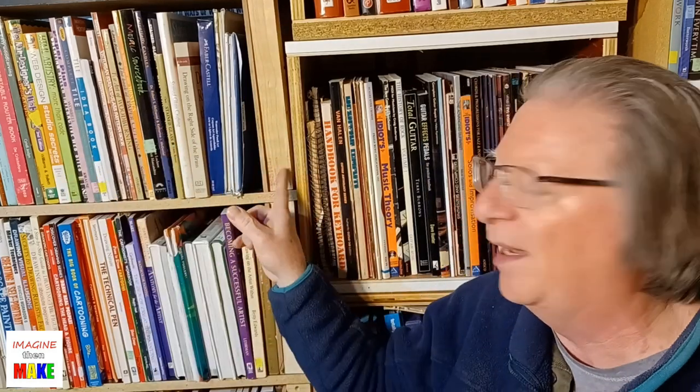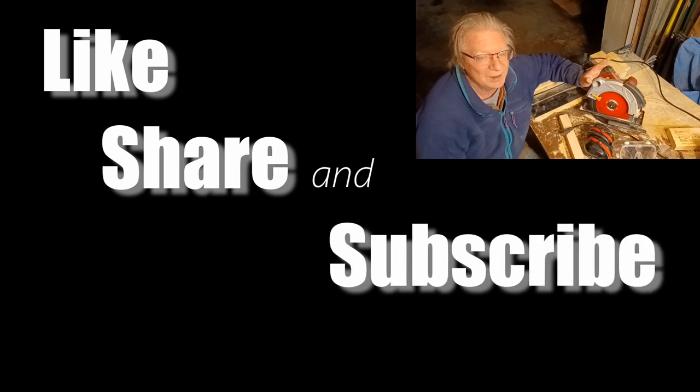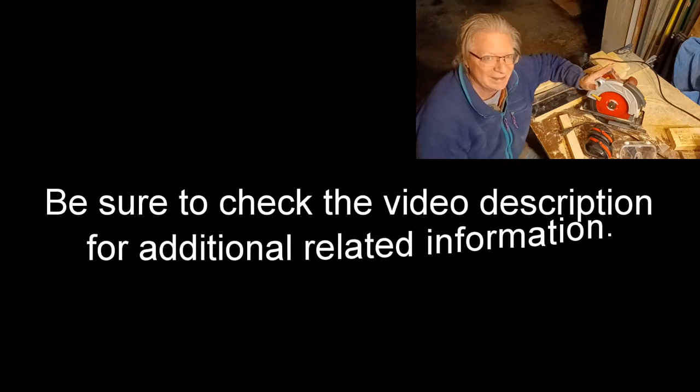Thanks very much for watching. My intention was to show you how I'm taking standard 2x4s along with a circular saw, the rip fence that came with it, and a simple jig I designed and built to make fairly accurate cuts to produce these sticks — I'm actually referring to them as legs now. The legs go into my latest bookcase design and I need to make a whole bunch more. In my next video I'll give you details on the inserts and the threaded rod that go in here to hold the whole bookcase together. It shouldn't need to be said, but I'll say it anyway: you're responsible for your own safety, so be smart and be safe.